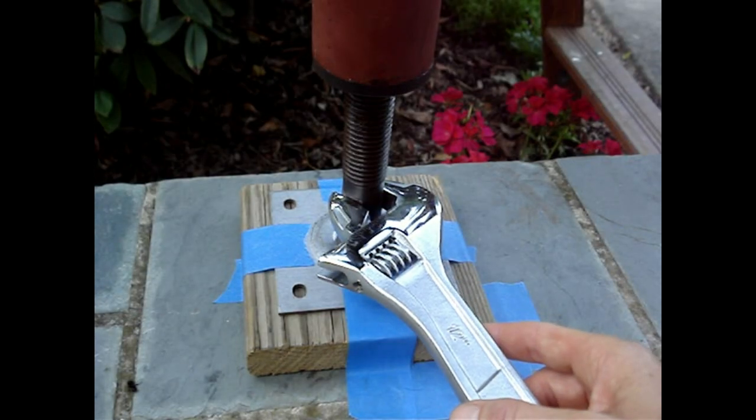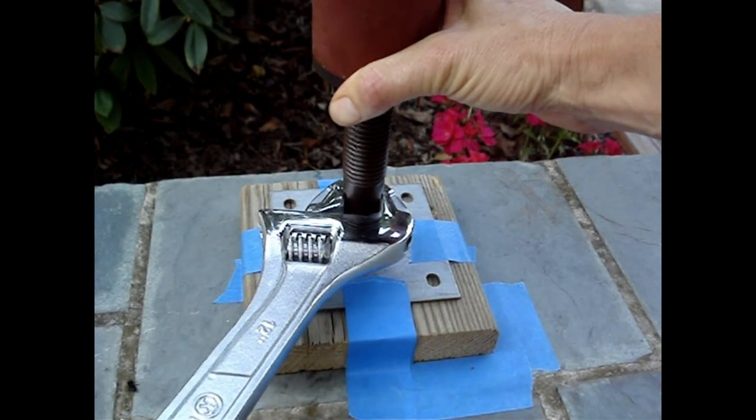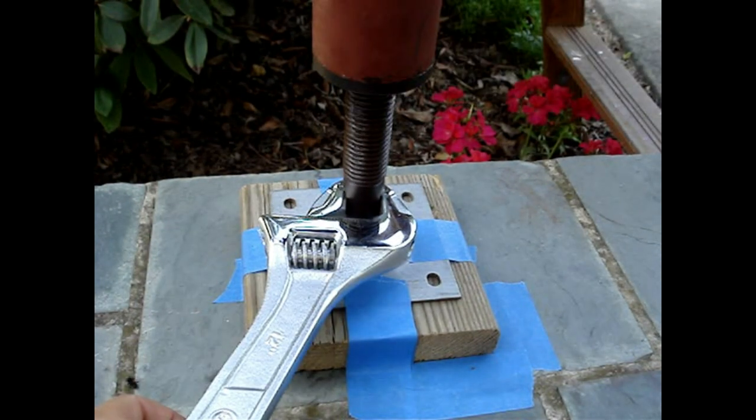To lengthen the post, turn in this direction. When you feel the first resistance while tightening the adjusting screw, stop — the post is now slightly compressed. The top plate should look like this, with the top post covering the raised circle in the center of the plate.